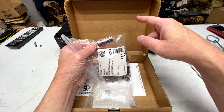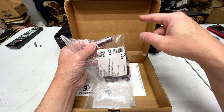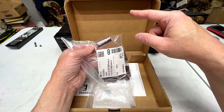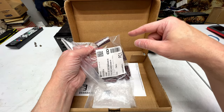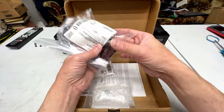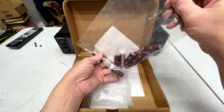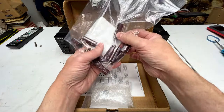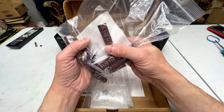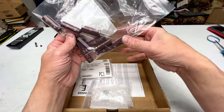The ones in there are rated at 63 volts, I think, and 25 volts, I do believe. But the 25 volt ones are running at, I think I measured, 20 volts. So they're almost already maxed out right there. And then the 63 volt caps are only running at 16 volts. The reason they're like that is because they're audio grade caps from some weird unknown capacitor supplier. And I decided I would rather just go in with brand new Chemicon KYB parts for all four of those. So that's what's going in there.